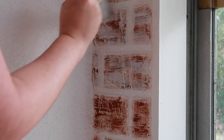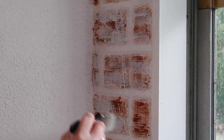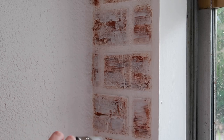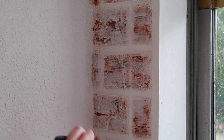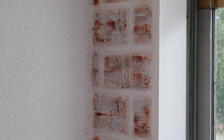You don't want to do the whole thing — you do want to leave some brick showing. You can still see the brick through the whitewash, so hopefully I didn't do too much, but if I did it's not a big deal. I think that actually looks good.